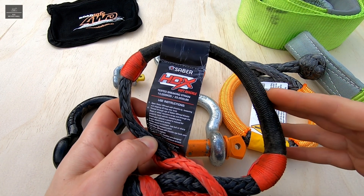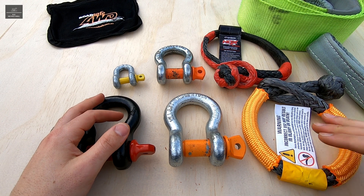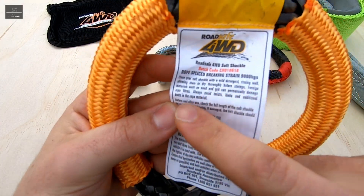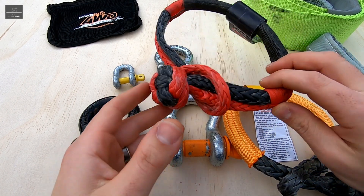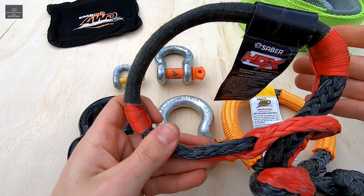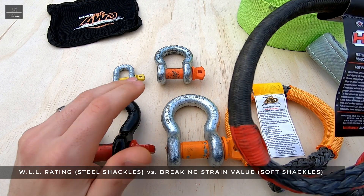You may be asking why this matters — after all, in a recovery situation you wouldn't be using a soft shackle in a lifting arrangement. Unlike a steel shackle, because a soft shackle isn't designed for lifting, it's not subject to the same load ratings. You won't see a working load limit value on a soft shackle, only a breaking strain value. This means there is no safety factor, or only a minimal one, built into the rating. Therefore, if we applied a typical safety factor of 4 or 5, a soft shackle rated at 10 tonnes is actually only rated to 2 or 2.5 tonnes working load limit — which I find a little misleading, as people often compare soft shackle ratings to steel shackle ratings thinking they refer to the same thing when in fact they don't.